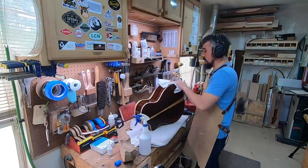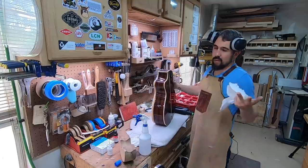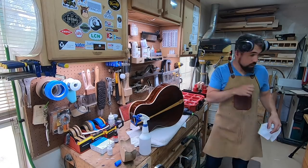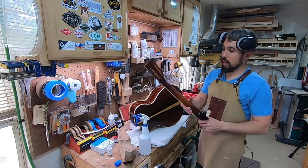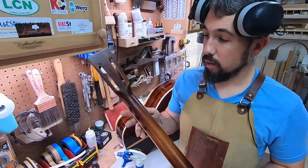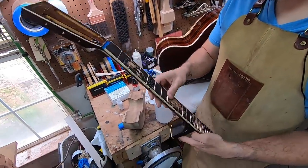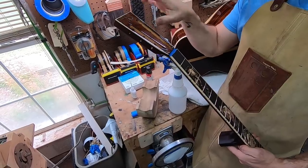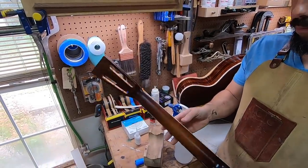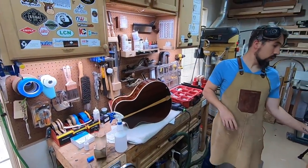The process is the same on the sides. I do have to do a lot of it by hand in the waist and in the cutaway area because the sander won't fit in there. On the neck, I ended up doing a satin finish, so I don't have to do the full buff out there — though the same process would apply. I don't normally remove the tape off the fretboard yet. The only thing I'm going to do is buff out the front of the headstock so it matches the guitar — on my satin necks I do a glossy front of the headstock because it looks really nice.